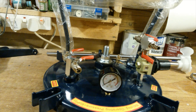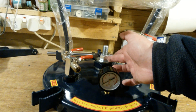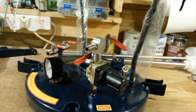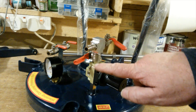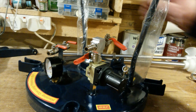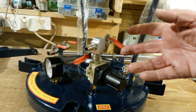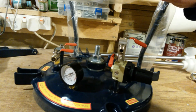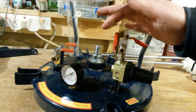That's all the changes I'm going to make. When I looked at pictures of this online, all that was changed was the handle was removed and it was plugged with a nut, bolt, and rubber washer. These two ball valves were left in place. This block was removed along with this ball valve and connector, and then a replacement connector is screwed onto this ball valve. But the way I'm thinking is, if you can leave those two ball valves then why can't I leave this ball valve in place? As long as it's shut there shouldn't be a problem, and if there is I'll change it in future.